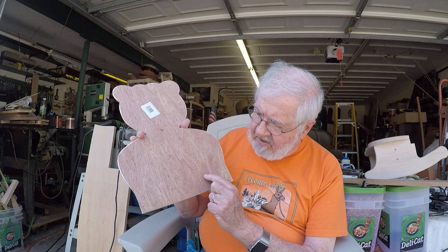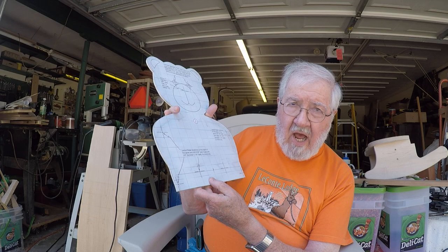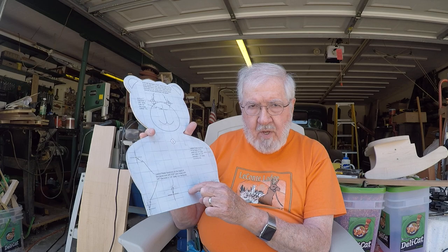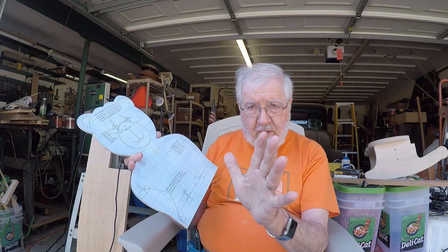The other thing I do — and I don't know if you can see it — but in the back here I've actually drilled some holes where holes are indicated in the blueprint. So that when I lay this on my stock, once I've cut out a piece of wood, I can use a pencil or an ice pick or a scribe to mark where these holes are and accurately place them.